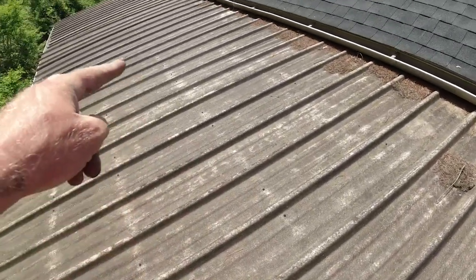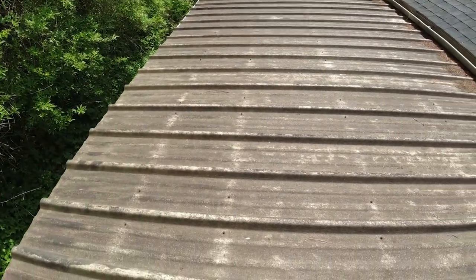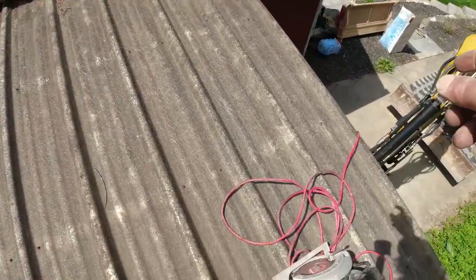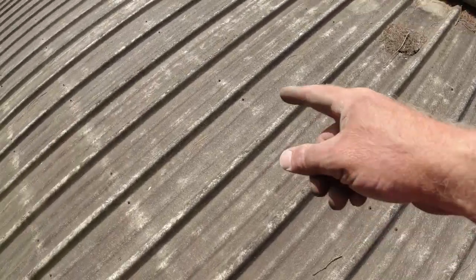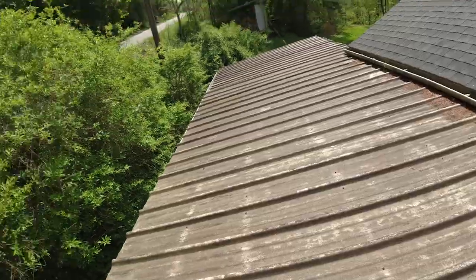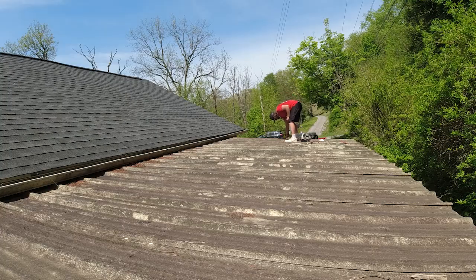Okay, so first, you can kind of see I have this line going from where one of the strapping boards is underneath. I don't really know why, but there's a highlighted line there, and there are screws every couple feet. So I'm gonna yank those out just so I don't clip one and send a saw blade shard flying up into my face. That would not be really that fun. So that's what I'm gonna do, and I hope you enjoy the time lapse of this.